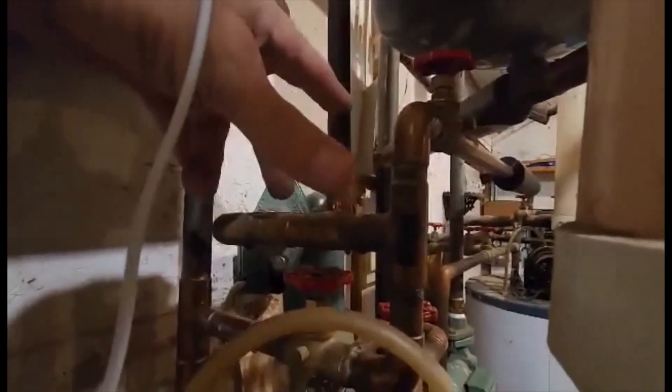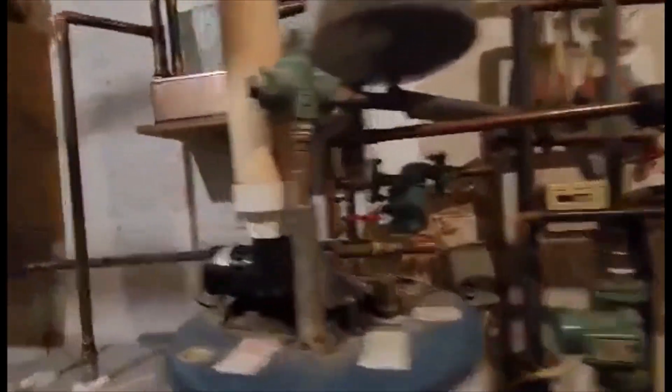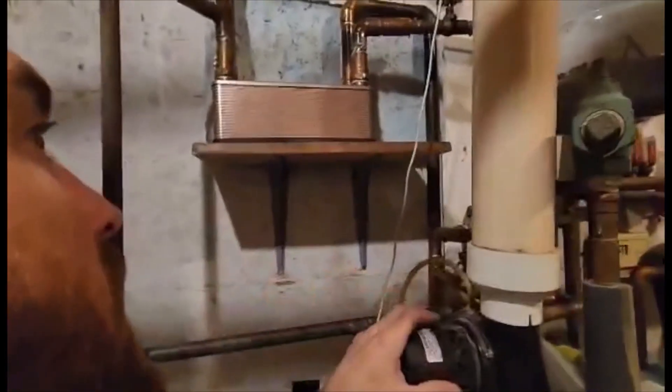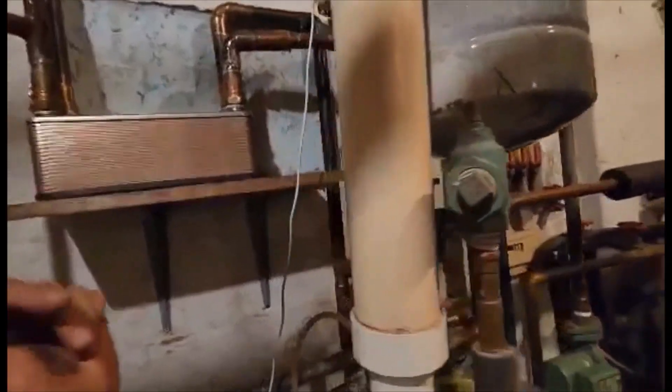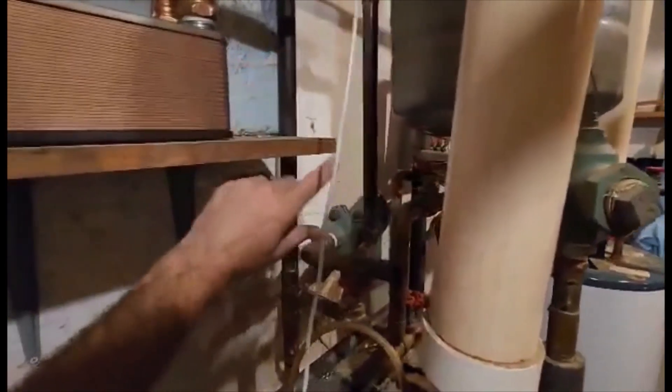From there we come in through here and back up into the heat exchanger. When we come from this pump through here, I'm able to add water yet again if I need to by closing this valve - this valve stays closed and I can add water to the system through here if I need to. I shouldn't really need to because it's a complete closed loop now. That's different from when I had it tied to the boiler - it's an open system on the outside with the boiler and a closed system on the inside. That's going to keep the water from absorbing oxygen and causing corrosion.